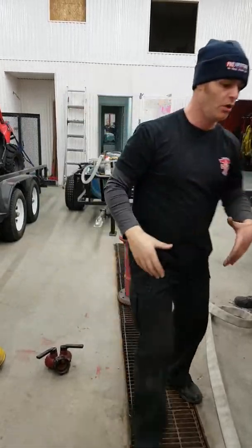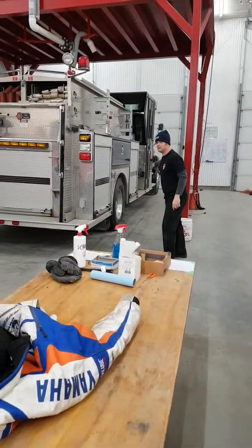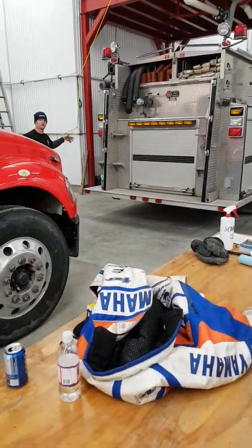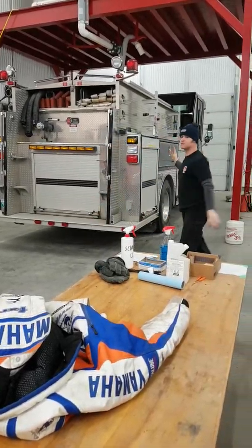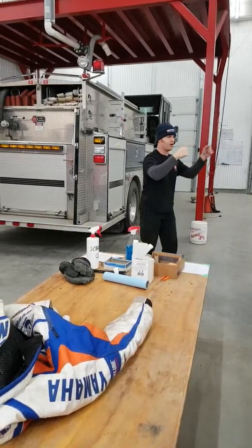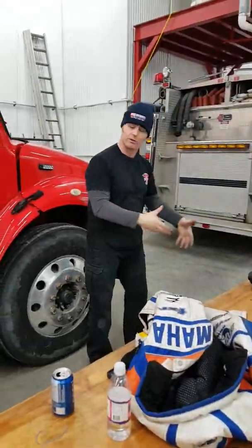Okay, so my highball hose, my 4-inch, should attach to my hydrant, and it should come either to that side to be connected, or to the other side to be connected, if you've got hookups on both sides. The transverse panel is nice, because I can see out of both sides. If I've got a side-mounted pump panel, it's usually on the driver's side. It's outside the cab, and all my levers and stuff are on the side of the truck. Okay, so if that's what you have, that's the style of pump, that's where I would hook my hose up to. Because then I know it's hooked up.